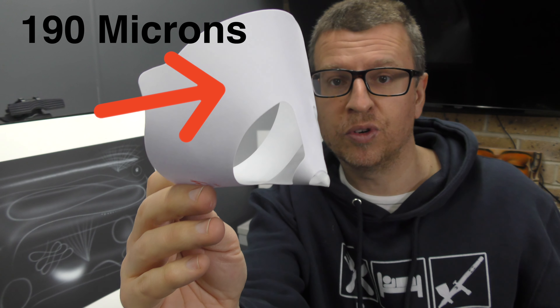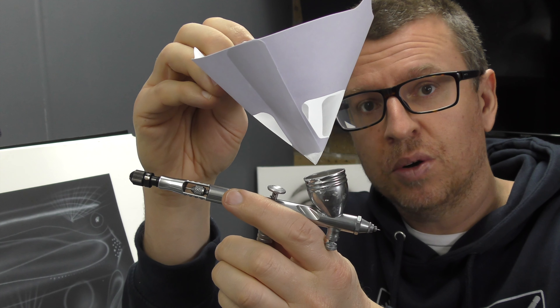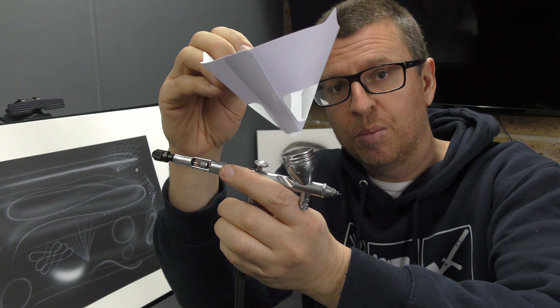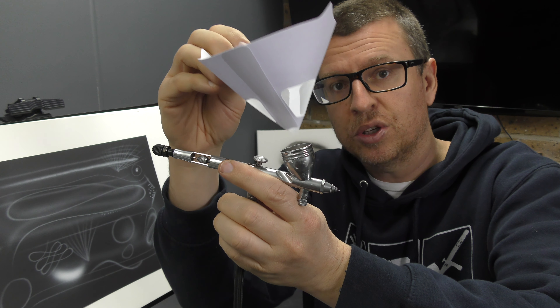Keep all those things in mind and persist with your white paint — it takes a little practice to get the feel for it. Get your paint mixes right with your other colors and then fine-tune your white. I also like to strain my paint, especially for the detail final tone — I want no dried paint contributing to tip drying. I use mini disposable filters: sit them hovering above the cup, pour your paint in, and you'll be certain it runs smoothly. Always pre-mix in a separate container, then pour it in.